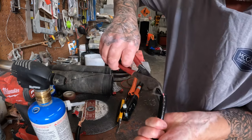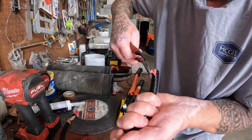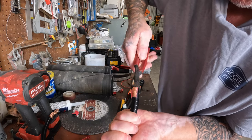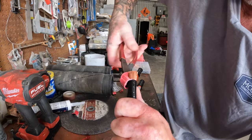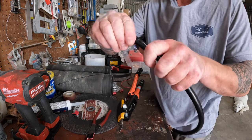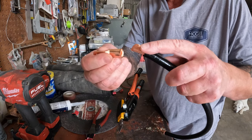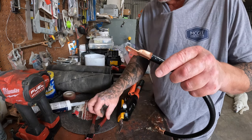As you notice here, I'm pulling the insulation off — you can see I'm tearing it, not cutting it, so I know I'm not cutting any of the copper wires. I can see it being torn there. I know for a fact I didn't cut any of those copper wires. If you've done it as many times as I have, you can feel it — you know the knife, you know the wires — but if you don't, then yes, get some proper stripping tools.